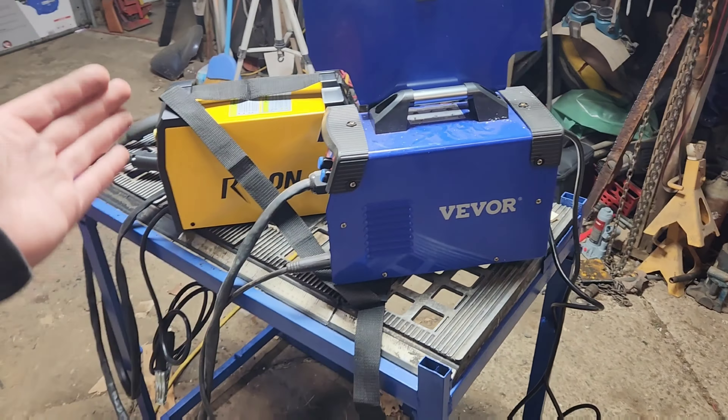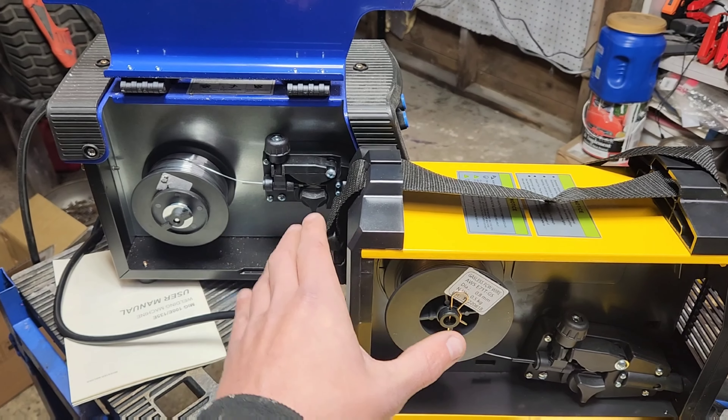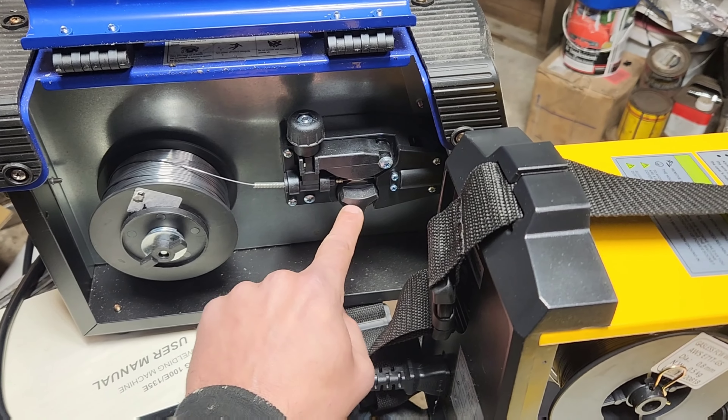The Vevor uses a replaceable MIG gun — it's your standard run-of-the-mill MK14. Both of these seem to have the exact same ends on them, but this one is non-replaceable. I can't believe this one is listed at $20 to $30 more than the Vevor, because the quality is horrible. They sent a one-pound roll; Vevor sends a two-pound roll. This thing doesn't even have a spring — all it is is a cotter pin. I've had it catch the cotter pin twice just trying to feed the wire in, so it needs to have a spring. The Vevor has a nice tensioner setup that you can vary.